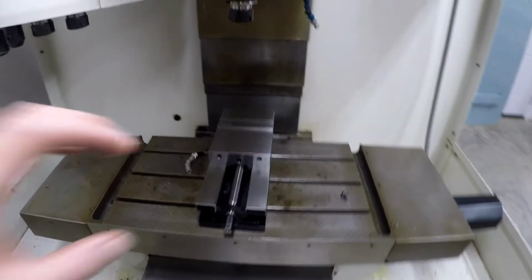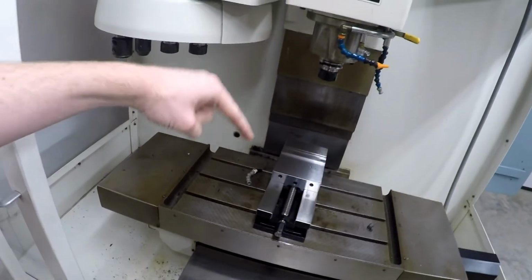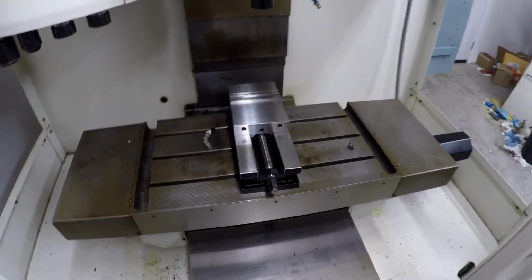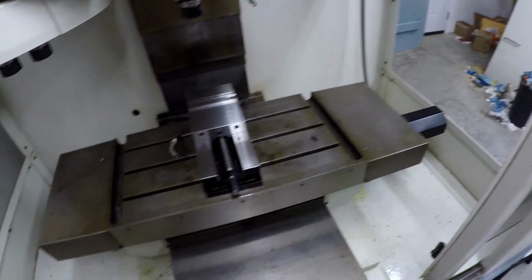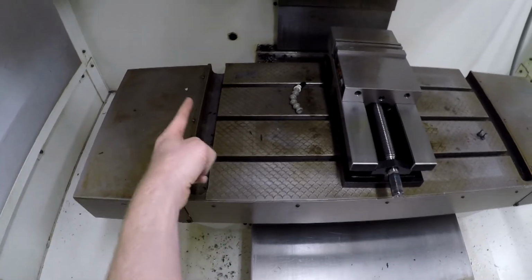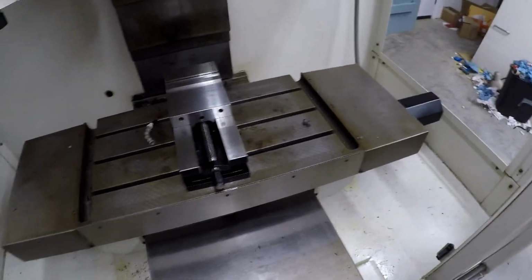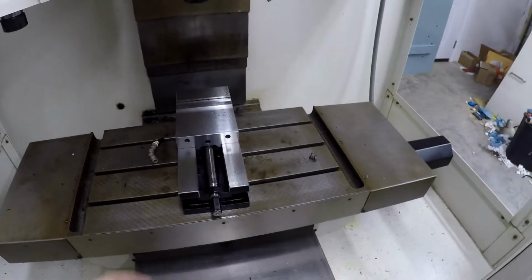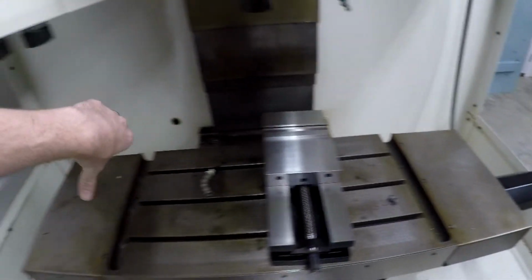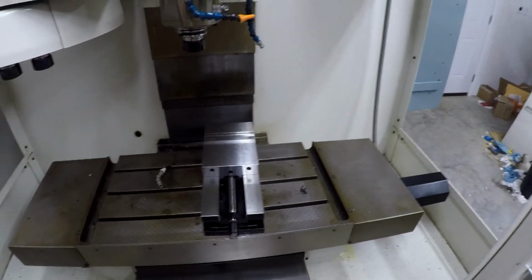So one more other reason why I got this with the machine sides was I'm thinking about getting a fixture plate for this guy. I've already talked to Saunders Machine Works, and they've designed one for me, and I've gone back and forth and confirmed the dimensions. For the VMC 15, it goes, I think, right where this channel is, and it goes over to this channel, and it overhangs this way, I think 4 inches. But it fits the whole thing, and I can use dowel pins. If I get the plate, I can put dowel pins in and then just bank this up, whether it's this way or that way or front and back. Just create a corner to bank into, and then my vise setup is done.